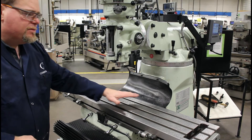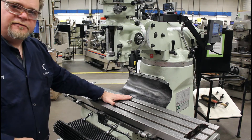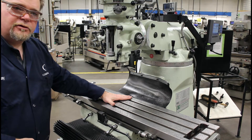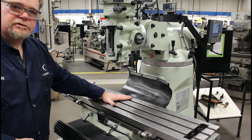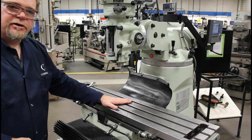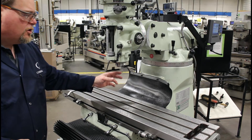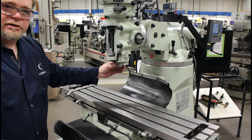If you're just doing milling, the only time where you need to have your head more than five thou in general is if you're doing holes or you're doing some precision angles like perpendicular angles that have to be spot on. But besides that, most of the time you can get away with it because your cutters are only small on a Bridgeport style mill like this. You shouldn't be using an eight-inch cutter.